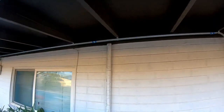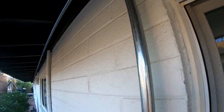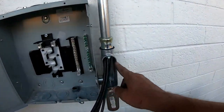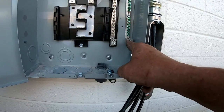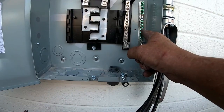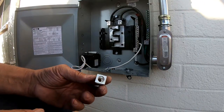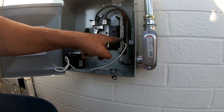Down here I put two hangers right at the end. Coming down, I'm nice and even with that wall all the way down. Now my wires come out here, they'll go through the nipple. Since I'm using number four wire, number four will not go into the side of these standard lugs — the biggest you can put in these is number six. What I want to do is show you how I hook the common and the ground to this smaller lug. You're going to buy one of these grounding and bonding connectors.